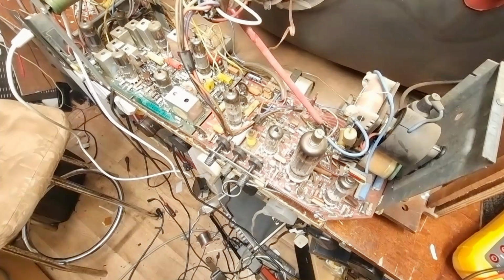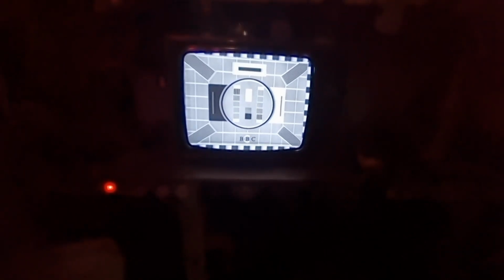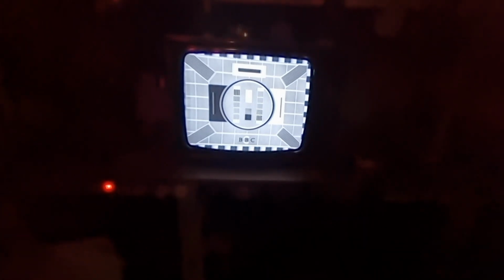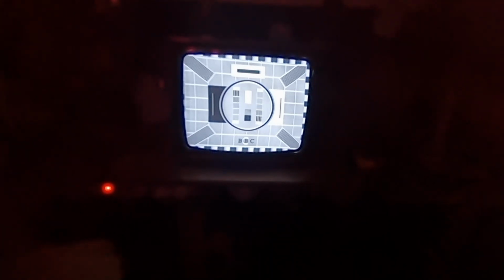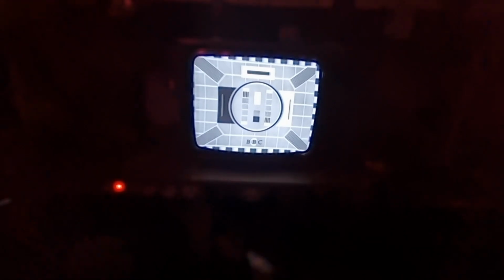Alright. Let's turn the set around and have a squint. Right, so that's how it looks at the minute. Turned around and switched on, and we can compare to our little monitor up there. The frame scan's pretty linear now. Happy enough with that. Obviously it's not centered right. The picture shift magnets are a little bit stiff. But we're getting there. We need to pull the picture up this way into the corner a bit.